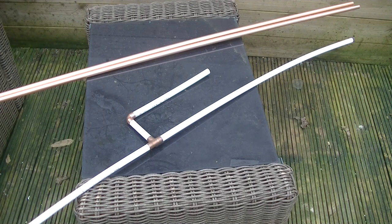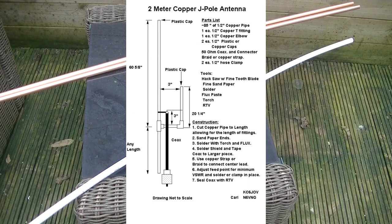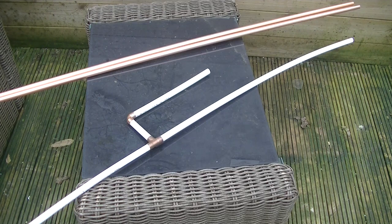Really simple to make. You just need to get the measurements correct and then solder on the coax in the right places to get the SWR right. Here's the online instructions. I can pop a link in the description where to find those for the measurements. Not my plans, someone else's. I've just got them off the internet, but there's plenty out there. So we will have a go, cut some pipe up, put it together, and I'll check the SWR after and see how well we get.